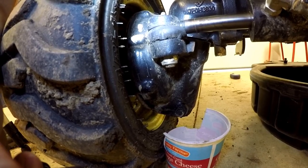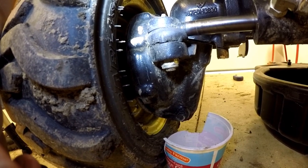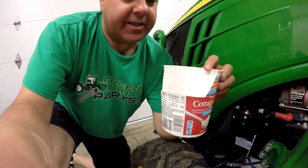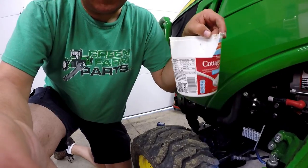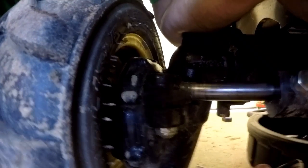There are additional drains out here by the wheels. These are a lower part of the axle and they just wouldn't naturally drain from that plug in the middle. Since those are a little bit lower, I could have probably put it on a jack or used some other approach, but I just used an old cottage cheese container with the side cut out — this is how I intend to catch the oil there. I'll place that cottage cheese container under there. Again, it's 14-millimeter.